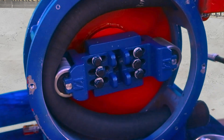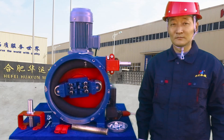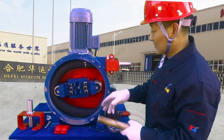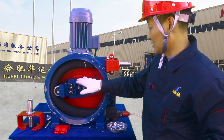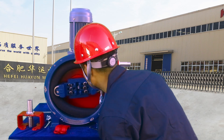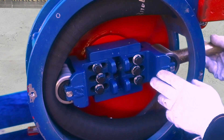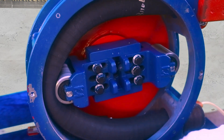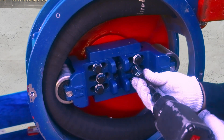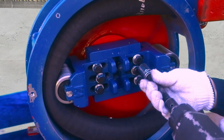If you are not sure, measure the distance between the highest position of the pressure roller and the inner wall of the pump shell to determine the initial zero position. The initial zero position distance of this pump is 25.2 mm. Before fully tightening, you can use a copper hammer to fine-tune the position of the pressure roller bracket. Be sure to restore the factory initial zero position value. After adjusting the position, tighten the pressure roller bracket bolts.